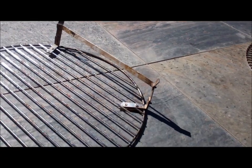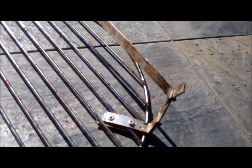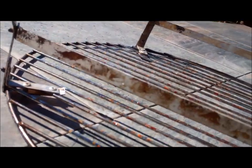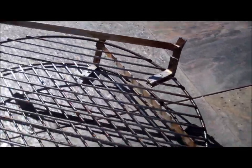This is the third generation, done with flat iron, because I don't have a welder — so I used rivets and some stuff from Lowe's. It's a handle that sits above the grate and has little flanged edges on it. This allows you to grasp your food and lift it right out of the Weber. But also, these vertical pieces allow a grill grate exactly like it to fit in and lock into place. The vertical part locks it in place — these things can't slide or move around — and yet they can be placed just about any way you want on top of each other, without regard to direction. They just stack on top of each other.